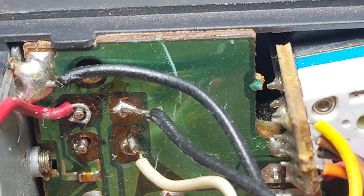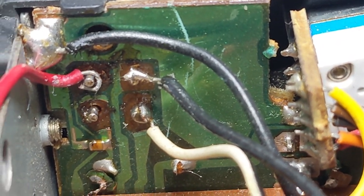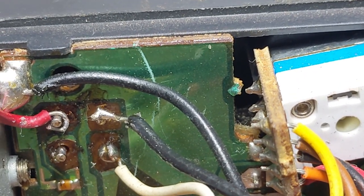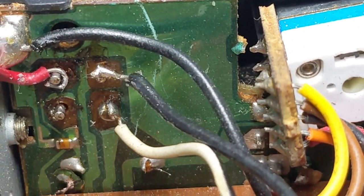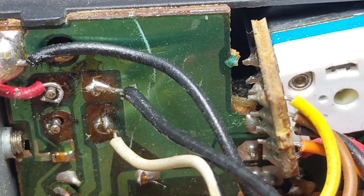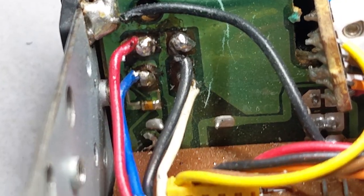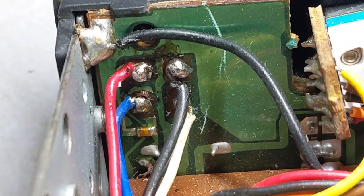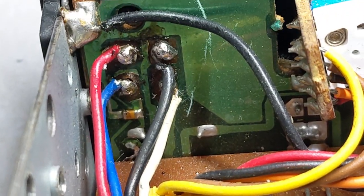As I'm soldering along here — I didn't do the other two yet — I made a little circle with the wire, because as I was heating those up they just came right off. So I used the soldering desoldering tool and sucked that old green broken board off. Their studs were sticking out so I'm just going to make a little circle and solder those on like that. I've got the wire going through the bottom of the board up through the top, and now I'm going to go to the bottom and do some soldering down there to get them hooked up.